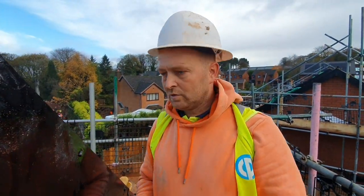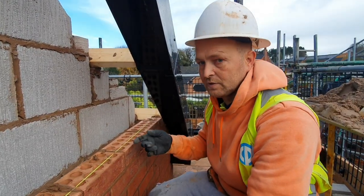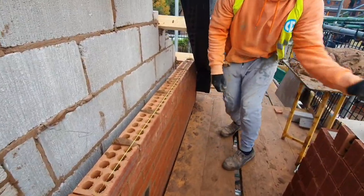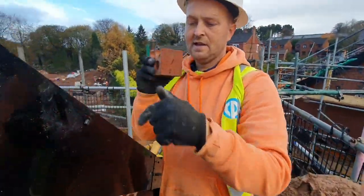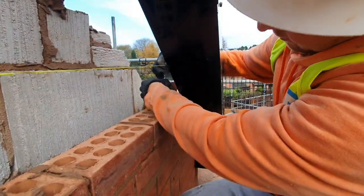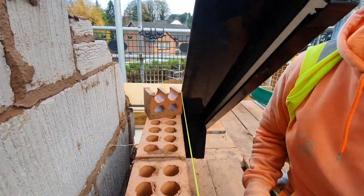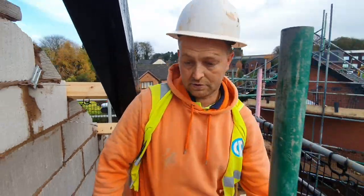On these ends, normally a lot of people like to build these up with a level in the corner and pin off them. What we like to do now is just release that bit — pull the brick off the top. We nail on the ends as we always do, put some quick little plates to get in and out. Then what we've done is cut a brick to 75mm, done the same the other side. All we do is pull the line up, trap it there, and it goes over the top of the brick every time. As long as this one's right, it's going to be 75mm every time — perfect. No taping, no nothing.